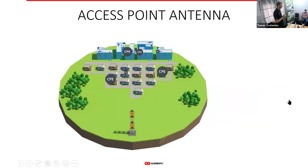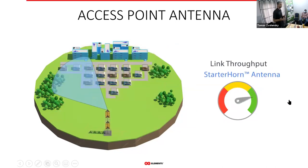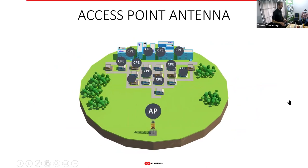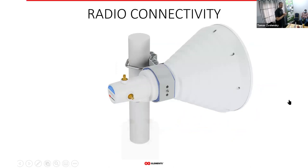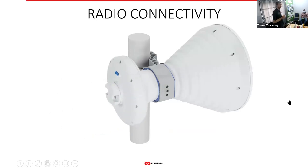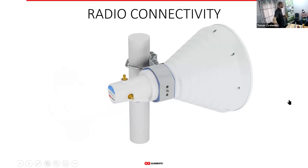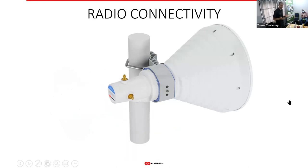The 90-degree starter horn is an access point antenna. Replacing a noisy patch array sector with a starter horn, you'll notice the difference immediately. The RF performance is great — very similar to the twist port horns. In terms of connectivity, the starter horn includes the adapter in the package, so you don't have to buy anything additional. You can directly connect a Ubiquiti or MikroTik radio without anything else needed.